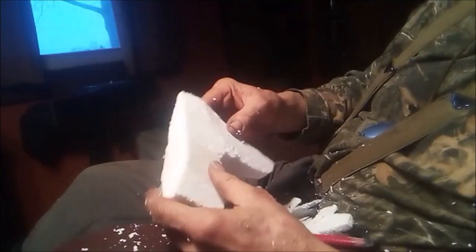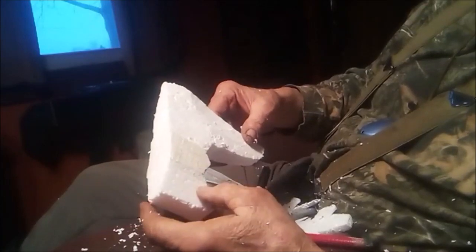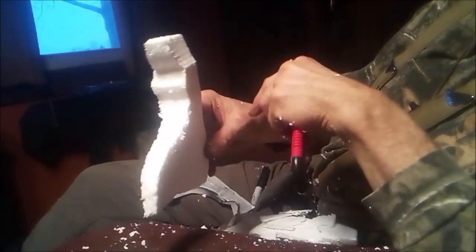We get a receptacle which will hold sand, and we fill the bucket with sand, which I'll probably just use a 5-gallon bucket. I'll put a layer of sand on the bottom of the bucket, probably about like that. Then this will go down in the bucket, and then you start pouring the sand maybe a couple inches at a time. And then you tamp the sand all the way. Moist sand, it has to be moist. Tamp it all the way around and keep adding.